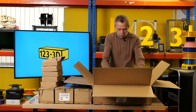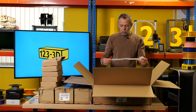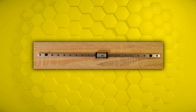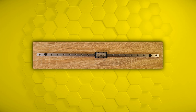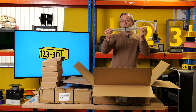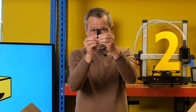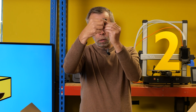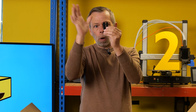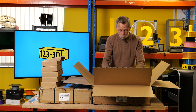Next up we have the stainless steel linear rail kit. I'm not going to pull each and every one out but I will pull one to give you an idea. Here are your stainless steel linear rails. They have provided end stops to stop the carriage from flying off the end and all your ball bearings scattering wherever you may be building. They also enclose a couple of slide blocks - if you do need to remove and clean the rail, you slide the actual bearing block off the rail onto these little carriages to stop the ball bearings disappearing everywhere. I'll show you how this is done when we get to that point.